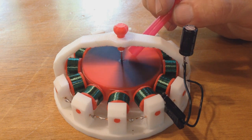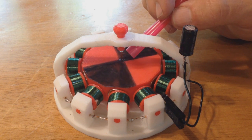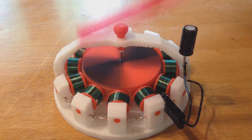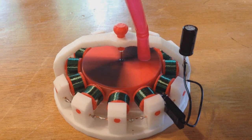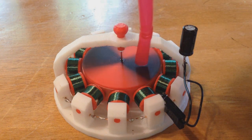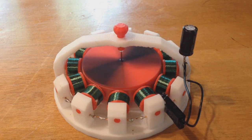So I'm dragging it here with this straw, and I've got a lot of drag on that motor, and I'm going to go ahead and bring it to a stop. So now it's stopped, and then I'm going to start it again. And watch this, folks. I'm going to let this video just run now. Let's go ahead and put a little more drag on it for a second. So you can hear that this motor has some torque. And all that drag is still getting fed off this electrolytic capacitor here.